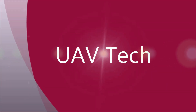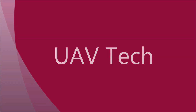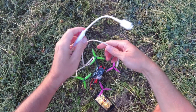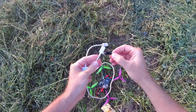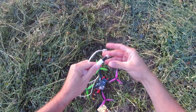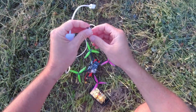Today we're going to show you how you can pull off your black box data just with a smartphone. It's pretty simple. All you really need is a quad and then your OTG on-the-go adapter with a USB cable that you can plug into your quad. A little trick is to have this small adapter that can switch from micro USB to USB-C, hot glued on, so you're good to go no matter what flight controller you have.